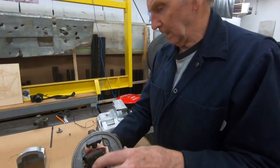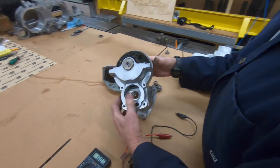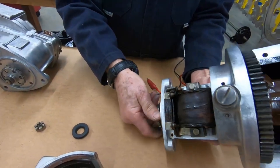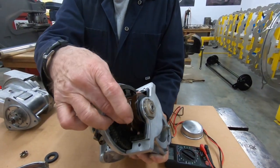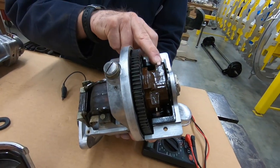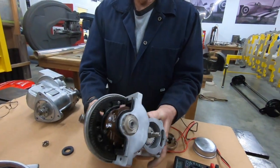The next part is this gear here goes in, and that's what actually drives the rotor as it's turning — that small gear is turning the large gear. Every time the field collapses, the spark comes off either the inside track because you've got an A and B bank. Each one of those is an A and B bank — that's why the two tracks are offset, because one is on the inside. It's producing sparks on both sides of this coil and out to the 12 cylinders or 12 spark plugs. There are two mags, one on each side.